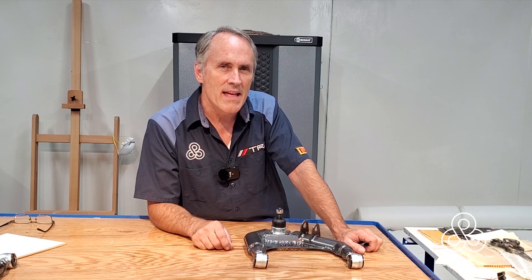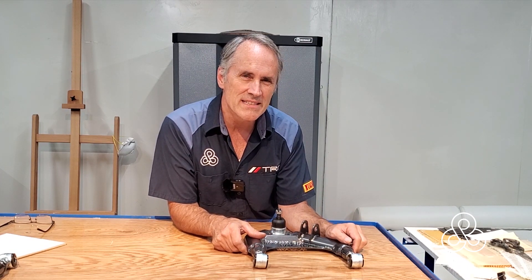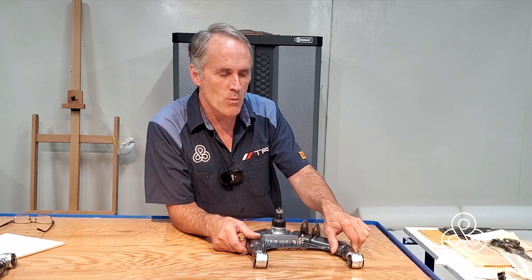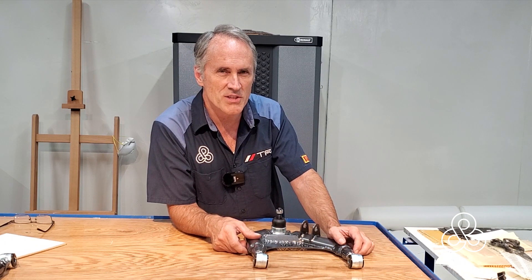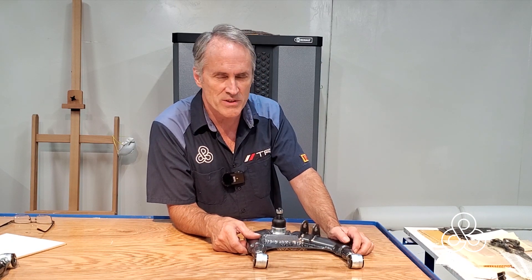The second suggestion: if you're welding chromoly and mild steel together, or chromoly to chromoly, never weld anything that has about a 30% or greater increase in mass or thickness of materials. So if you have an eighth-inch or 0.095 tube — something lightweight — you don't ever want to weld that to a half-inch thick plate. There's just too much difference in mass. The heat is going to be pulled off by the heavier plate and cause the thin wall to cool rapidly, and that'll cause stress cracks in that weld.